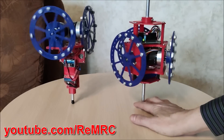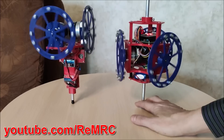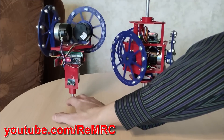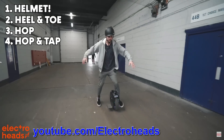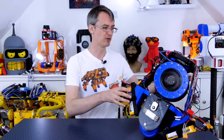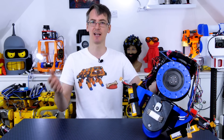This device is not the same as a reaction wheel. A reaction wheel balancer uses a mass rotating around a centre point in either direction to push the device back the other way to make it balanced — there are quite a lot of those on YouTube already. I haven't seen anyone make a one-wheel balancing robot that uses gyroscopic precession to stand still on the spot; if you think you've found one, let me know in the comments. It also isn't the same as an electric unicycle, which won't stand up stationary on its own — only when moving, balancing front to back like a Segway. We could make this radio-controlled by biasing the set point with a remote controller to make it lean and drive forwards or backwards, but steering with only one wheel is tricky.